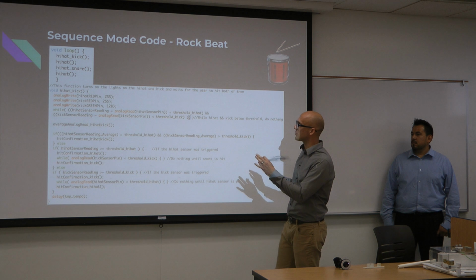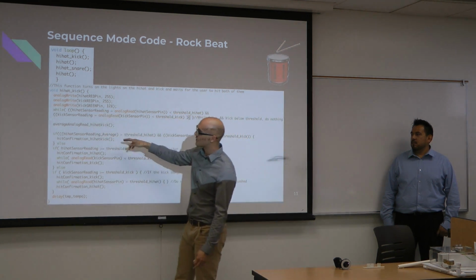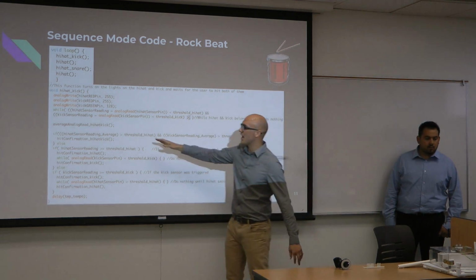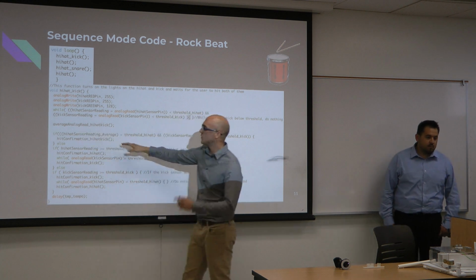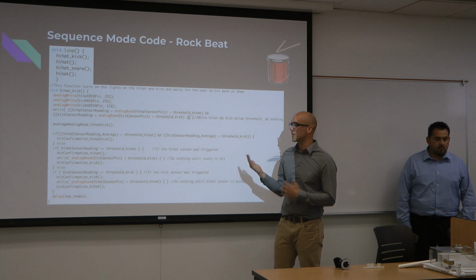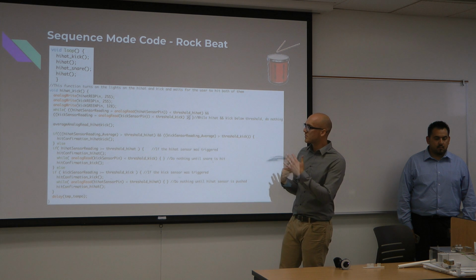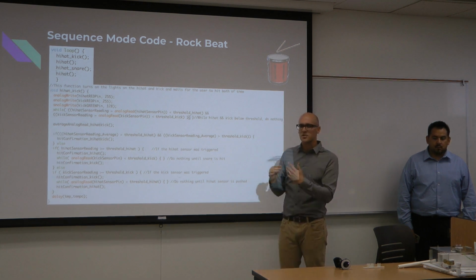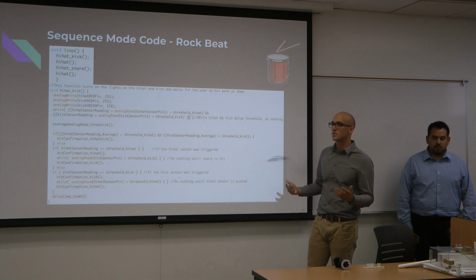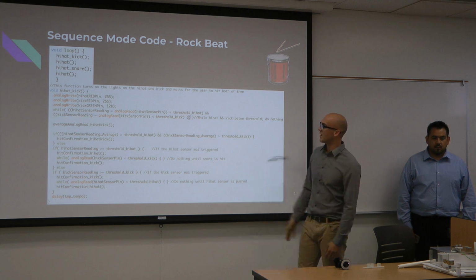So you can't just use those, because I'm storing them in variables right here. At that instantaneous moment when it leaves, you have one that's high and one that's low, so it wouldn't actually turn both off. So I had to do what I'd call an average analog read, which basically took a number of samples after. I read it n number of samples, like 500 times, discarded the ones that were below the threshold, kept the ones above the threshold, averaged those out, and then used that value to determine if it had been hit at any point. So that was one of the problems that we came across and fixed this time.